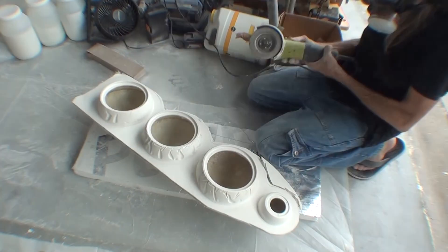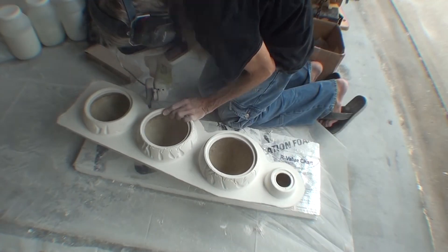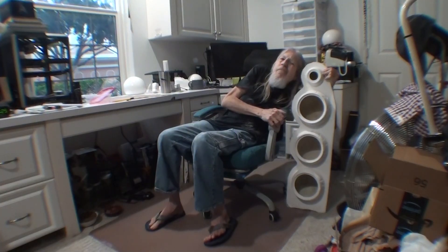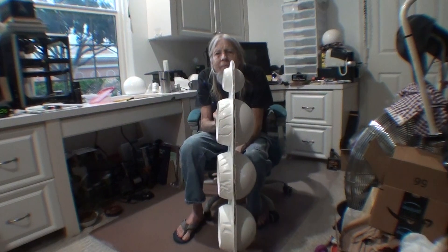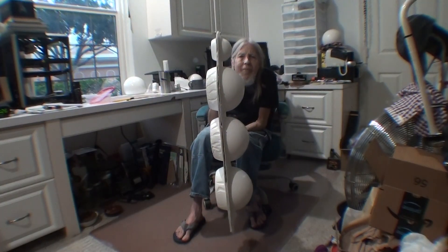Since this is a sort of a pathfinder I'm experimenting with two different styles for the side: one is just straight sides and the other sort of curves around the curves of the speakers. This is what it looks like at this point — it's got a bit of a front-back curve to it, sort of a banana shape. This is the height of the tweeter, and you kind of want the tweeter about the height of your ear. The real one will be a little bit higher, which I think will put it at just the right height. You can see how it's curved here like a banana, and I think having some boards to clamp it would make it perfectly straight each time.